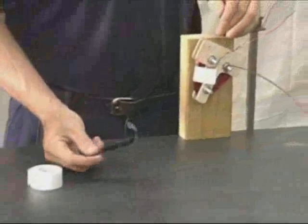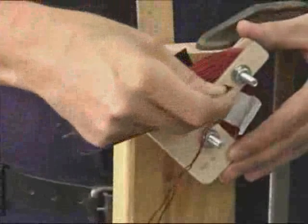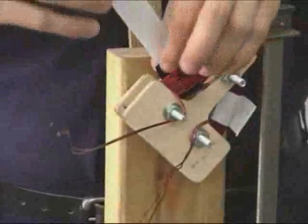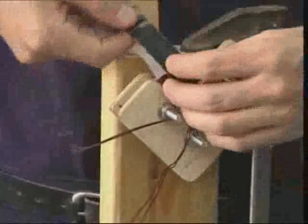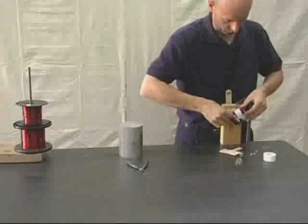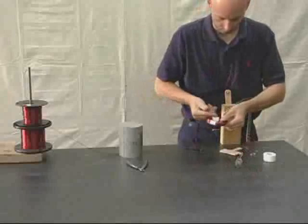This is a simple but very helpful tool used for taping the coils before removing them from the fixture. It's just a thin strip of metal that's been bent by hand. Slip it under the coils and pull the tape back through. After two sides of the coil are taped together, carefully remove it from the fixture, then tape the third side.